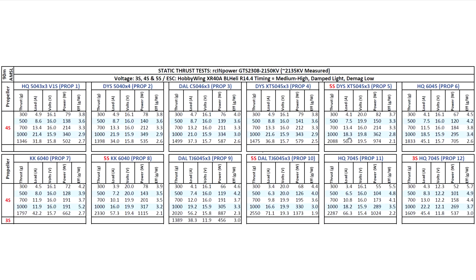Still very reasonable amps at 50. Keep in mind these amps are high because this is static thrust — I'm measuring max amps, so that's burst, only for a split second. In the air the amps are going to be a lot lower, usually 35 to up to 40% lower depending on the weight of your copter. So don't let these high amps scare you — these are kind of exaggerated. On 6-inch props making quite a lot of thrust: on 4s 1800 grams, and the amps are very low. Comparing to other motors I've tested — the 2306, 2507, 2407 — this taller stator motor is actually using fewer amps to get the same thrust.